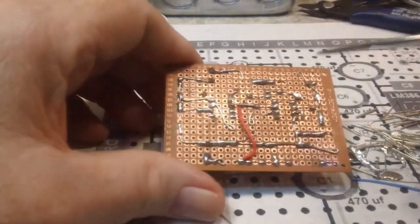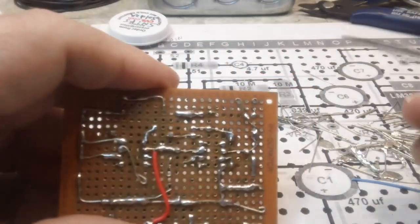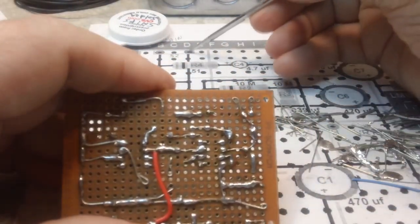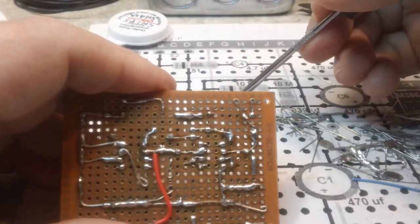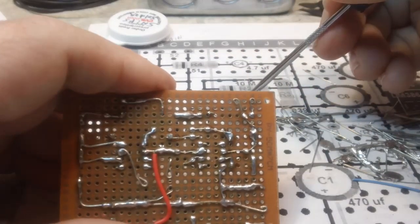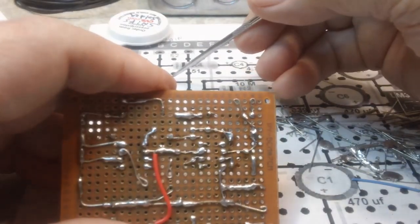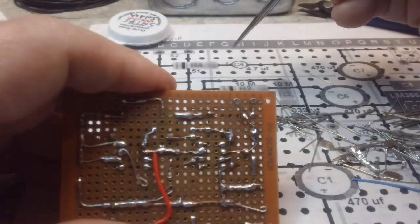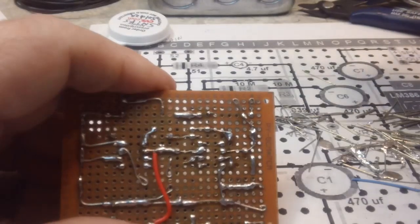This is the ROR. I got it right this time. ROR signal tracer. Now this time I've been working on this. Actually, this one here. If you guys can see that, this pin goes all the way down to pin 2 of the 741 chip, and it also stops off here for VR2, which is the pot that controls the gain on this chip. So that's what that does.